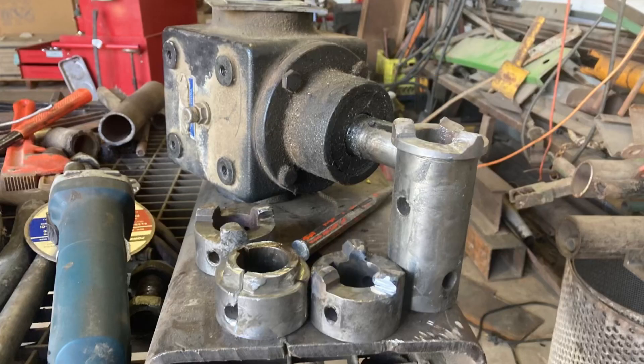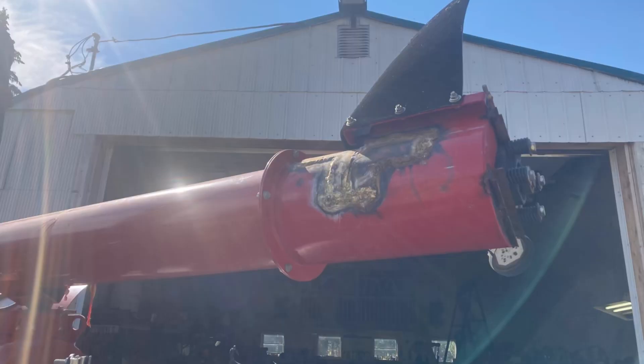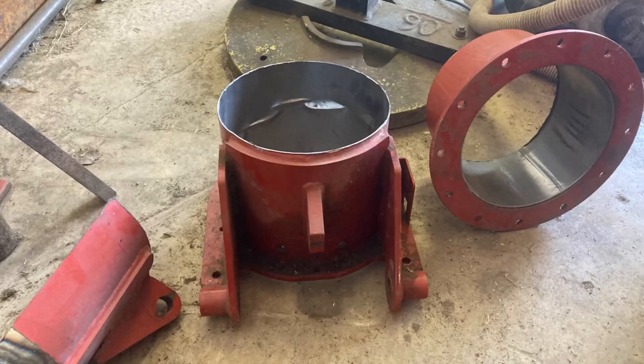You will also become very familiar with replacing, repairing, and redesigning drive dogs. Your first 400 hours — that should have been relatively maintenance free. You will replace almost all of the flighting, almost all of the tube, the drum, the bearings that hold the drum, the belts that drive the drum. You will go through bags upon bags of shear pins because you will not understand why they're breaking, because you didn't understand the term 'drive dog.'